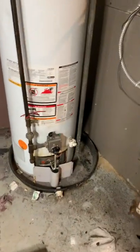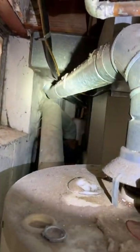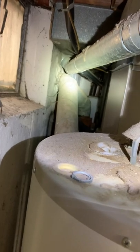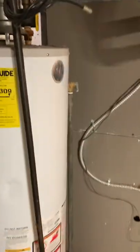The water heater for the second floor — looking at replacing this too. It's a 40-gallon natural gas water heater. The flue piping is just going through the chimney but is not catching a flue liner, so we will need a liner installed. We'll need to go with the shorter version of the 40-gallon just so we get the right height, because we'll probably pop right into that 6-inch hole for the furnace. Then cap that one, modify the gas, add a new expansion tank.